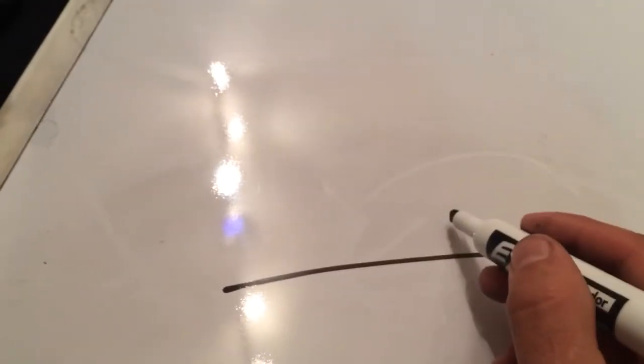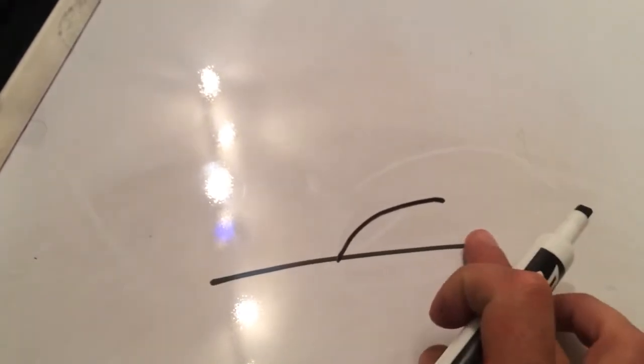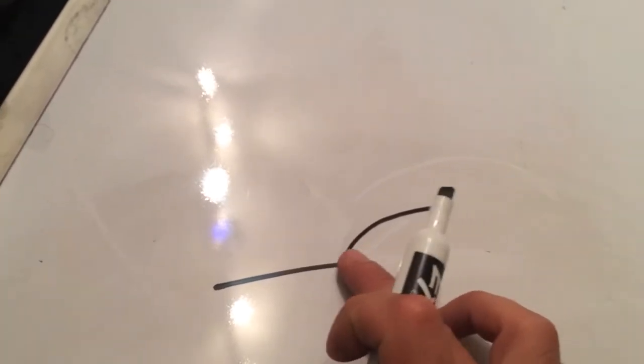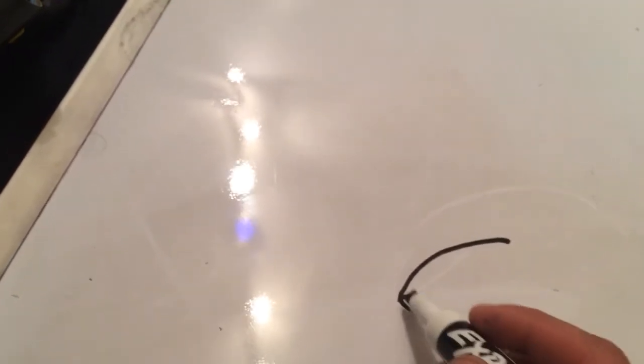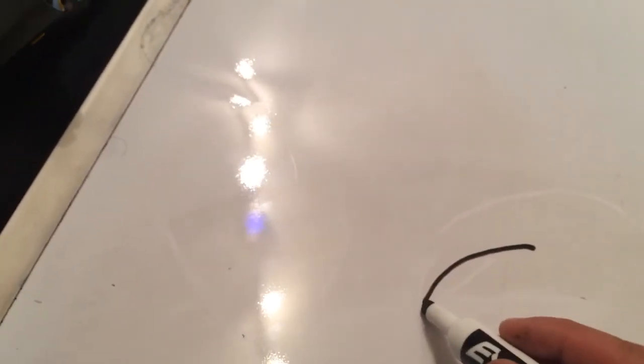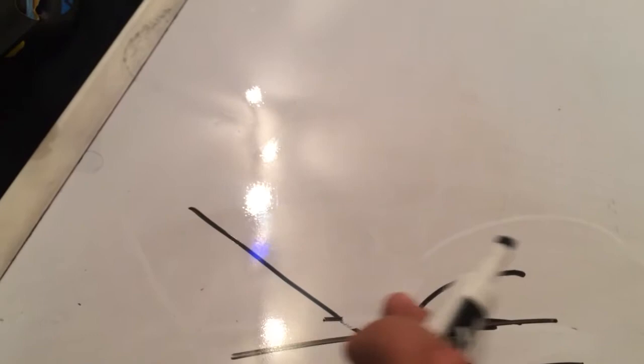However, going with your flat medium with your Rockstead, which has this convex edge, it'll give in to the soft medium, and instead of giving and rounding your edge out, you're actually forming this apex, which is very fine at the tip. Even though you have these rounded edges, your soft medium is going to conform around that and form a tangent once it's pushed on there, and naturally form this edge right at the tip. So, with that said, that was my first method.